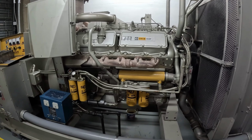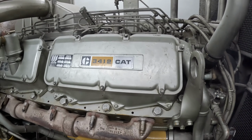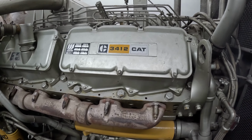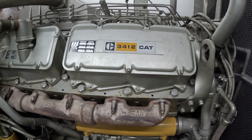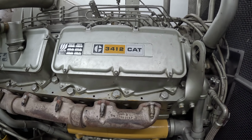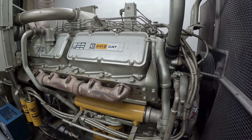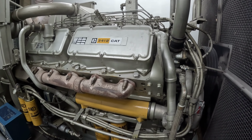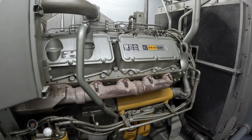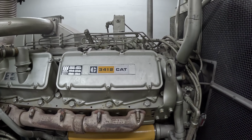But during the last inspection, I popped the cover off of this side of the head, and I could see the telltale signs. There's always a trail of coolant running down from the injector cups, and that's how it just flows past. The seals are probably shriveled up and deteriorated. But I'm going to be going through how to reseal that today.